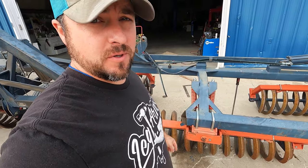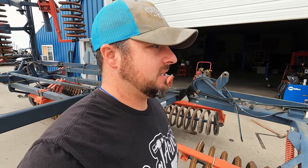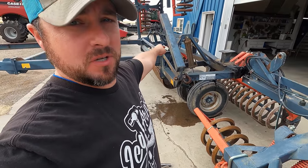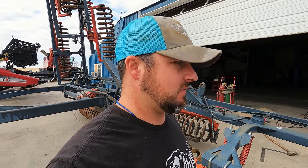Okay, we looked at it and looked at it and looked at it, and we finally decided to do something a little different here. This is actually a 4x4 tubing, and it would be nice if we didn't have to plate the outside. So we looked in a book from one of our steel places that we get from, and they do have 3.5x3.5 square tubing, 1/4 inch. So the inside dimension of that is actually 3.5x3.5. What we're going to do is take a chunk that's probably about 5 feet long or so, and stick it inside that tubing, and it's going to go inside this one. So then it's basically going to be doubled. And then you weld the whole joint up, and I think that'll be plenty of strength for this thing, and I don't think it's going to have a problem.